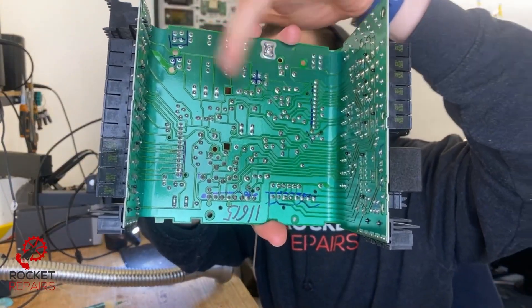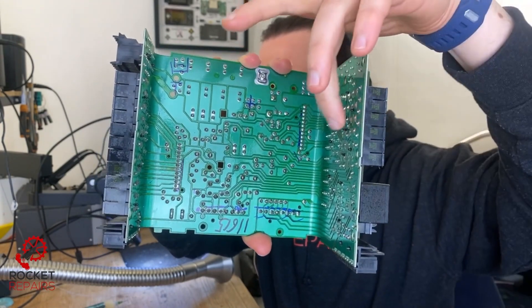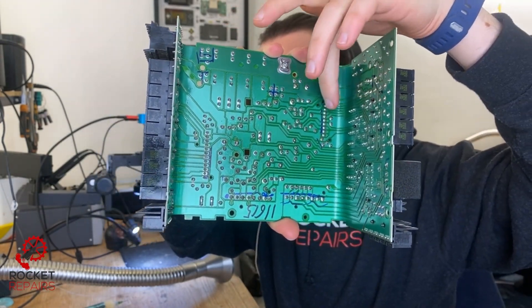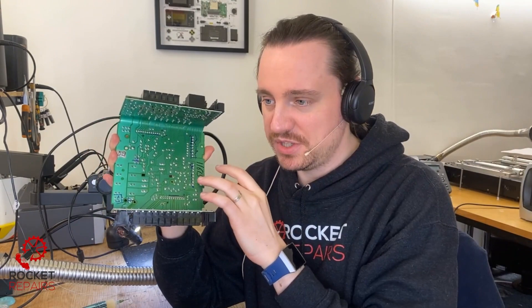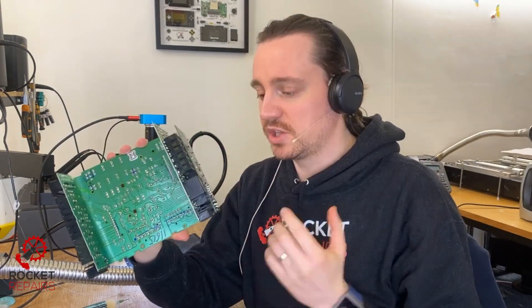As you can see, we have a lot of solder joints on this unit and the board is designed to bend. The first thing I'd done was check the traces on the bend that you can see here, from solder point A to solder point B on both sides, just to make sure we had good enough connections, which we did. Every single test point — I went through every single one — does have continuity. My colleague who was disassembling this took out a fuse, and one of the fuses was snapped, so we have noted that on the job.